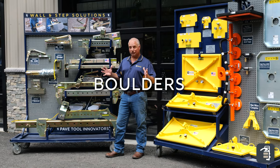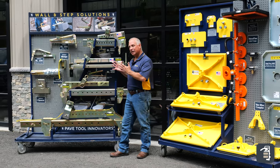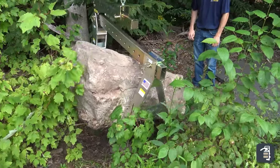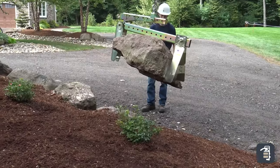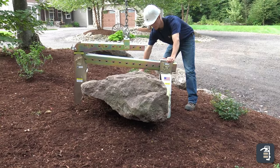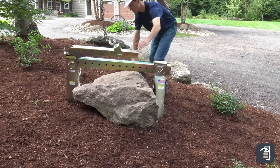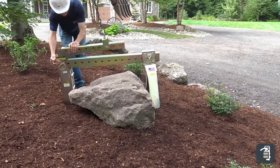When it comes to boulders, vacuum equipment is not going to be your choice. We're going to be limited and we're going to use a block clamp. Our 980, with the boulder grab attachment, is great to hook onto the 980. You can simply grab your boulders, and this makes it really nice for rotating and being able to set them in specific spots in just the right position. It's also great for some of your large blocks on retaining walls, some natural cut stone or irregular products. You can grab that product easily with the boulder grab and set it on your wall.